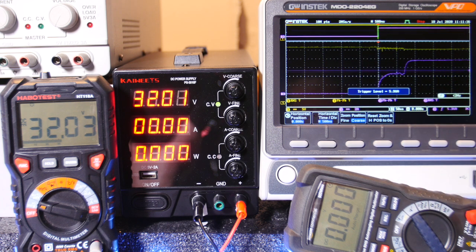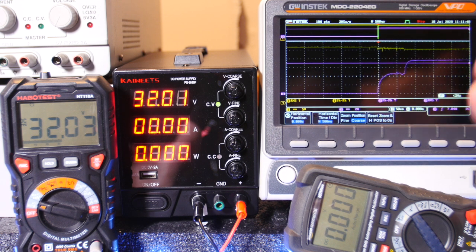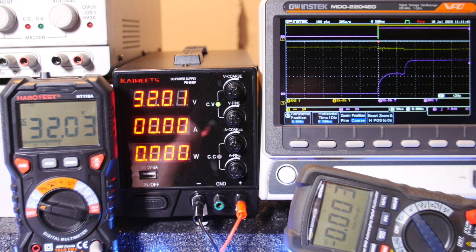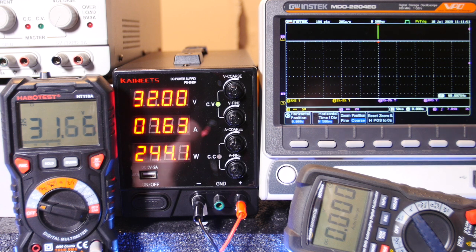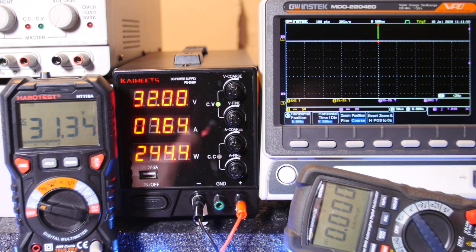Okay, the other thing, I'm going to go ahead and connect the load, and I'll turn the trigger all the way right below the max value there, and then I'll release it to see if, in release mode, the voltage bounces up, because that's also sometimes a tough thing for a power supply. It's part of the control loop thing. Okay, I'm pulling the current, and I'm going to let go.